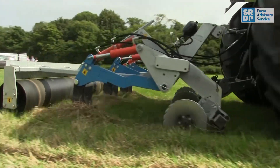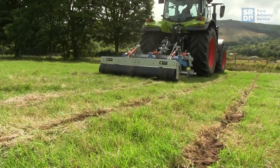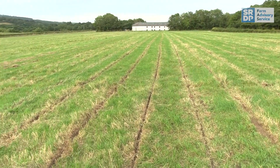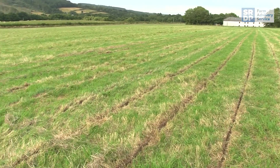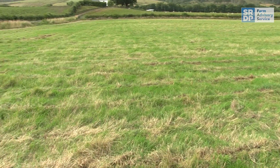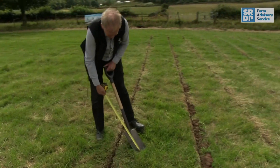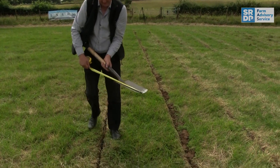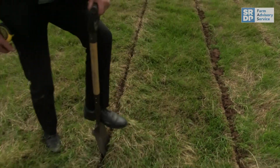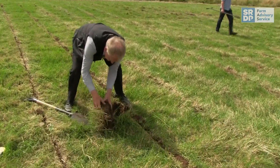Working depth is critical. Far too many people try and go in too deep. They've read a wee bit about subsoilers and think they should be working at 16 to 18 inches, and the reality is they're doing more harm than good at that depth. What we really should be working at is about 9 to 10 inches for a sward lifter. How do you assess that? Use a measuring tape and actually dig down after you've been through. The guy in the machine should have an idea what depth the tine is at - so nine and a half, ten inches is the depth you should be working at.